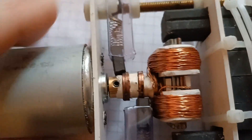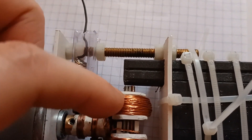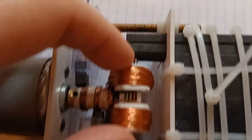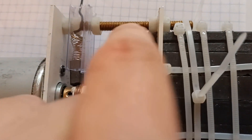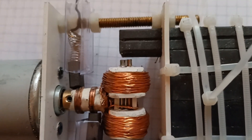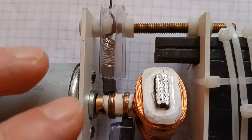On the shorting video you can hear it go slower. So you could say there is this theory about the coils being too close in proximity to the magnets, or these coils being too close to the iron bars, or maybe it's the angle — before it was one way and now they're at a different angle. I don't know, but it doesn't work anymore, and I can't just put the iron rods back because I took them off, so we're going to build a new generator.